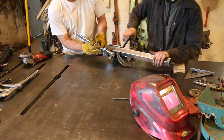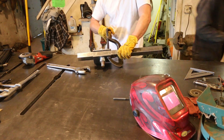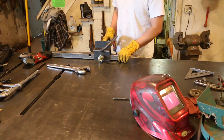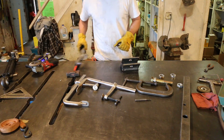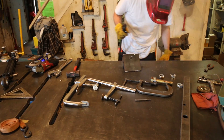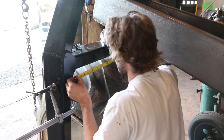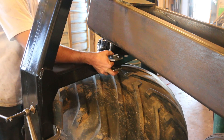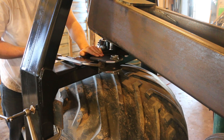Now that I knew the distance from the frame to the intersection point, I could make some brackets to hold the cylinder. Daniel stopped by to give me a hand tightening this big bolt down. I was clamping the top and bottom of the bracket to a piece of metal that was the right distance for the bracket to be spaced, then stuck a bolt through it and tightened it down so it wouldn't move. Once it was welded up I could pull that piece of metal out. I really wanted to build a couple brackets I could clamp in place and check the turn radius and tolerances before committing to welding it onto the frame, because I knew there'd be little variables that would make it different from the plans.